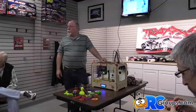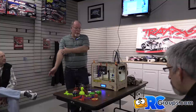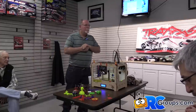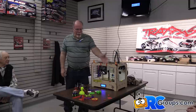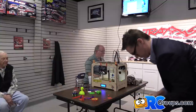Q: Is it difficult to maintain high heat? A: No — when you get into nylons a lot of guys will seal the printer up so you have a closed system that holds the heat in. Being open like this you probably wouldn't do nylon very well. It's amazing how strong the PLA is anyway. On the red filament roll I'm down about that much and I've printed tons of stuff.